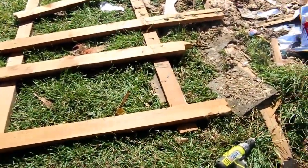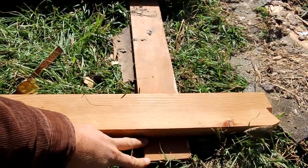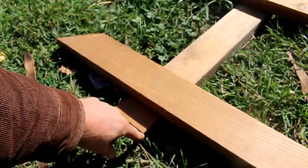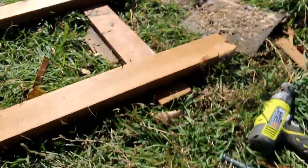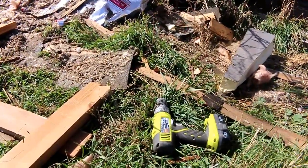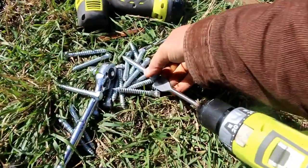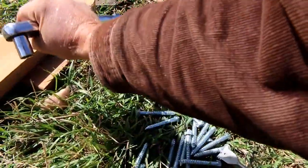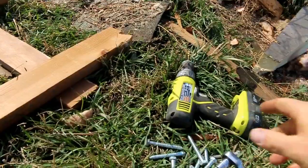It's really simple — all I have to do is start out with equal measurements on the bottom two sides. I've already measured two inches from the inner side, from that corner up to there. I've got two drills set up: one is my countersink — this is 7/8 inch — and that's plenty of room for the top of the lag bolts to fit in, and also my socket so I can countersink it, go about half an inch or so down. I've got these 3-inch lag bolts that will go through two layers of 2x4s just fine, but I feel much more comfortable having them sunk down, so that's why I'm countersinking them.